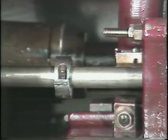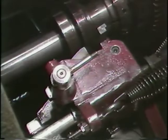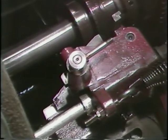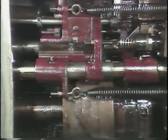The out of stock mechanism tells the operator when the machine is out of stock. In spindle position 6, it does this by having the stock feed shoe engage the trip rod actuating collar, which slides back to activate the cycle off switch and the out of stock light.